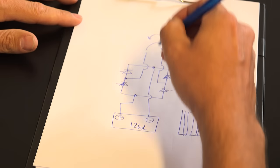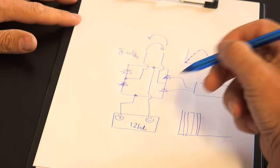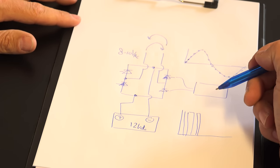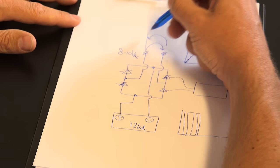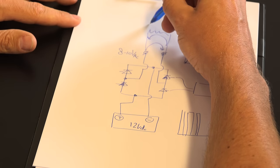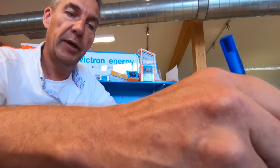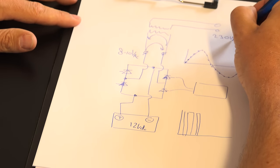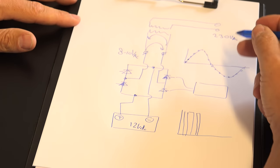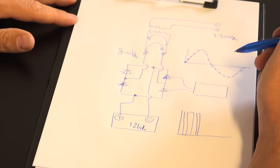If this is a 12 volt battery — 12 volt DC — then on the other side you have about 8 to 10 volt AC. This is the principle of making AC from DC. Of course this voltage is not usable for household appliances, so we connect a transformer on this side. A transformer has a ratio between incoming and outgoing windings, and with that we boost the voltage from 12 volts to 230 volts. If you need an inverter to make 110 volts, we simply change the windings in the transformer, so with another transformer we can also make 120 volts.